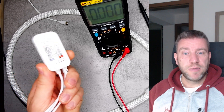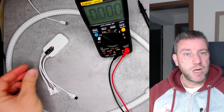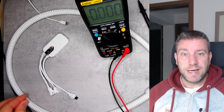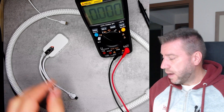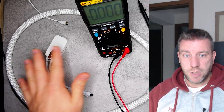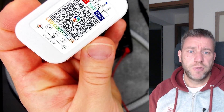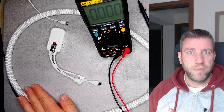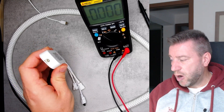As you can see, it comes with a controller and I started making some modifications to it. As I was testing, there was a pop sound, maybe a little bit of smoke, and now it's not working — technically I killed the light because the controller is still working. This controller came with the light; I paid for the option that includes it. It's a simple Bluetooth controller that supports 5 to 24 volts, but this strip is probably a WS2812B addressable LED, so it runs on 5 volts.